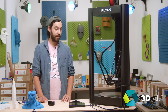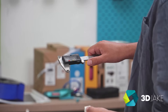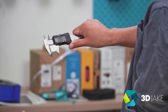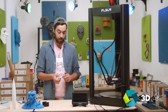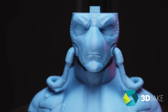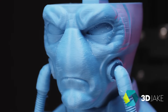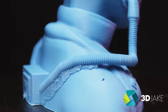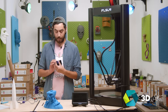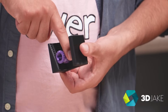We've also tested how dimensionally accurate this printer is bombing around at 400 millimeters per second — you would think it'd be a bit flingy with dimensional accuracy. The calibration cube came out well and this is actually also made of ABS so the PEI base is working really really well — no warping or elephant's foot or anything like that. The clearance test went up to 0.3 millimeters at high accelerations but unfortunately 0.25 didn't budge. One issue I did have was that at these high speeds and accelerations the support interface settings had some issues — you can see the scarring from the supports on this Cad Bane model I printed. Not great but not terrible. We also printed this gravity broom handle with a nice gear made out of satin PLA and regular eco PLA — tolerances are really nice, very smooth.